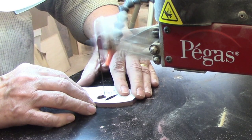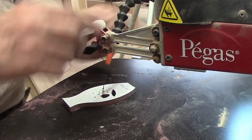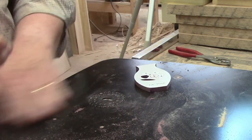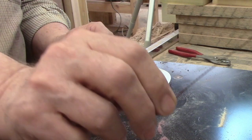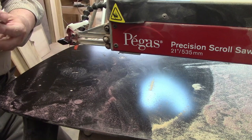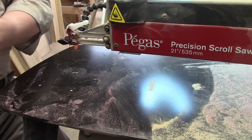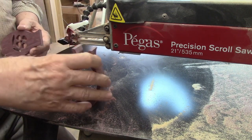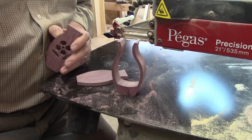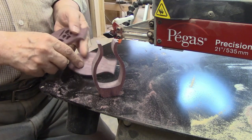Partway through cutting a second shape I made a small goof. Evidently I hadn't tightened the thumb screw on the lower blade holder enough and the blade slipped out, causing the blade to be bent — I had to throw it away and replace it. I grabbed a new blade from the holder I keep next to the scroll saw and installed it. This is a number five Pegas modified geometry blade since I'm cutting quarter inch material. Switching blades on the Pegas scroll saw is easy and fast. I made the last few interior cuts then pulled the pattern from the workpiece — this is why I like to use scroll saw tape. It holds firmly while you're cutting and peels off quickly when you're done, leaving no residue. I'll leave a link to my source in the description.